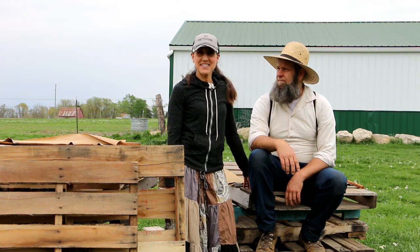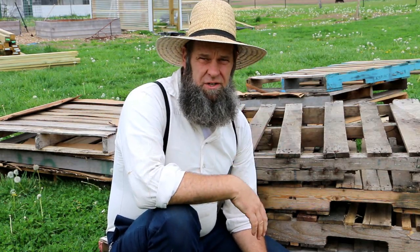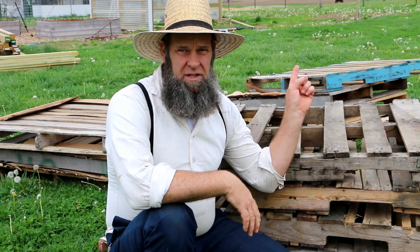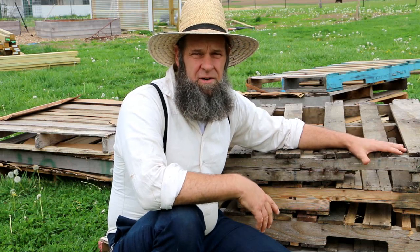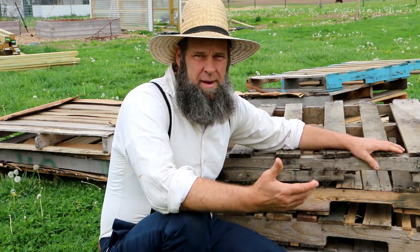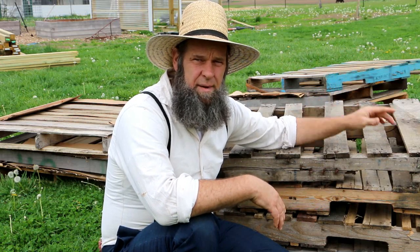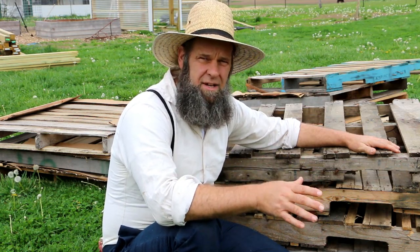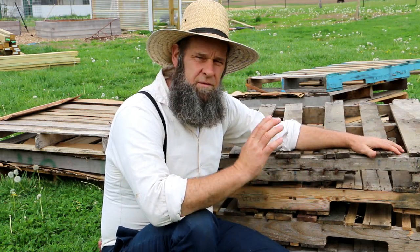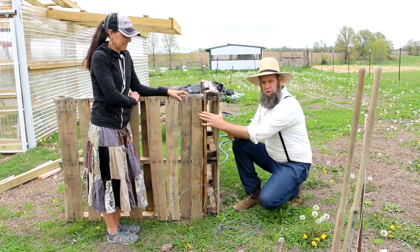We're getting our pallets together out of the pile. There are a couple things to consider when building something like this. See this pallet behind me — that's a blue pallet. You don't want to use anything with paint or any kind of treatment on it when it's in contact with your food. Most pallets are made from raw material and aren't treated, but avoid the obvious ones like that blue-painted one. The other thing to consider is that you have the same size pallets — pallets come in a lot of different shapes and sizes, so find four that are very close to the same measurements, as square as possible.